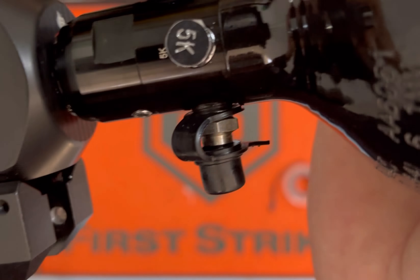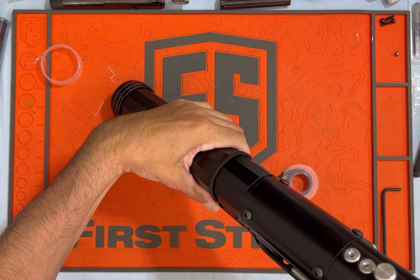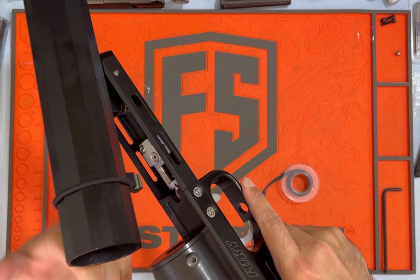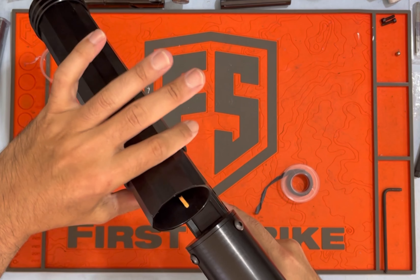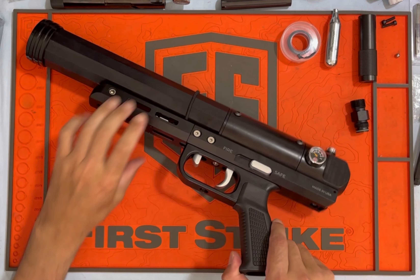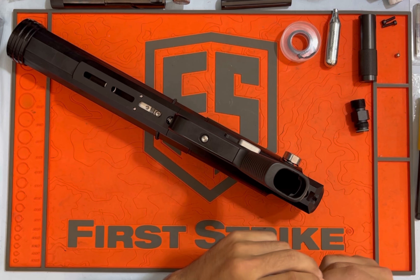One other thing to note: you can notice I changed the O-ring that was on here. The O-ring was maybe a little too stretched out, so every time I was closing this it was actually slowly chipping away at the O-ring and it just failed — it fell off. Wife's hair elastic to the rescue. Much more resilient to getting pinched in here now. It's probably not the ideal solution, but that works great.